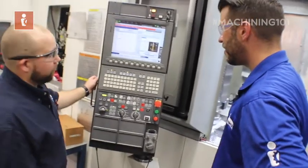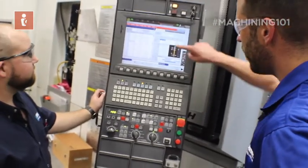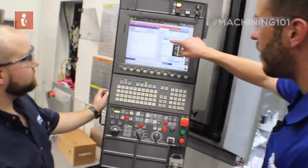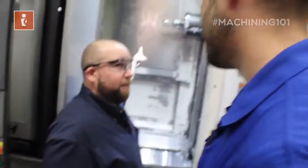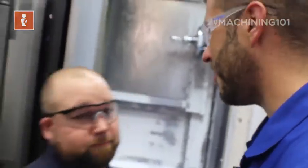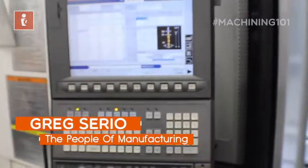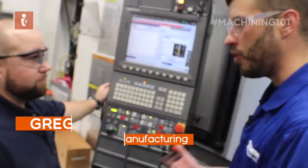It's going to put a value in that section right there. This value, 7.258 — what does that mean? We're getting a distance from the gauge line to the tip of that tool. That's what that number is. So now that we've set our tool offset, are there any offsets you have to do for your workpiece?